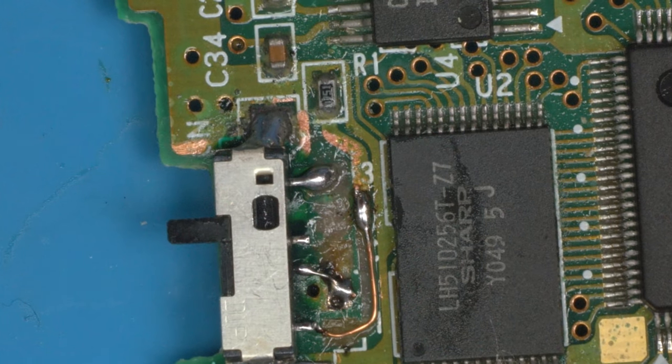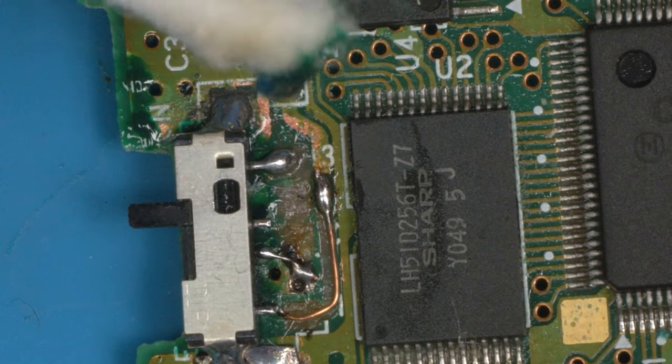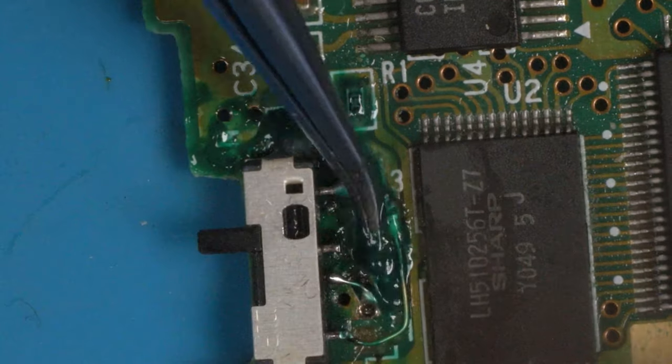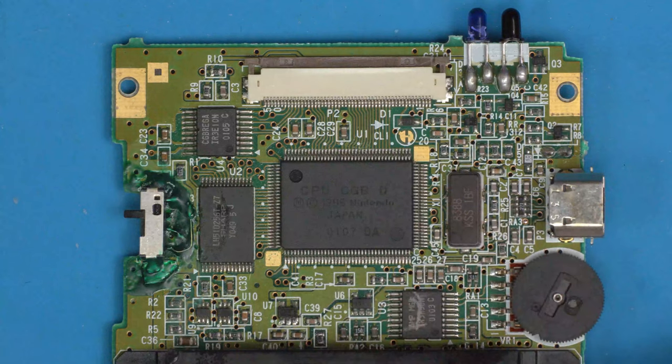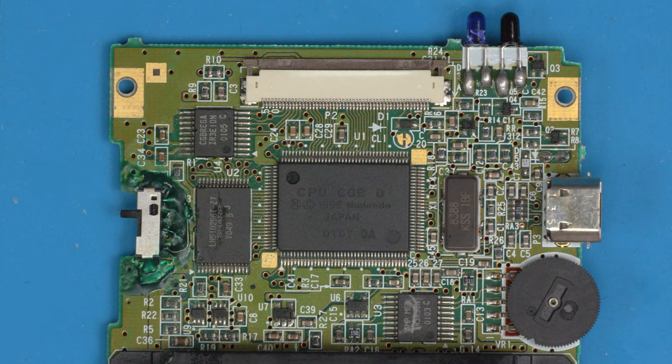I know it was in depth, but the main thing I wanted to cover was not just how to repair specifically a Game Boy Color power switch — I wanted you to understand how you can look at a board that's ripped anywhere and trace how you need to repair the circuit. You can use braided wire, copper tape, or anything else to bridge major areas. The ultimate goal is simply to restore electrical connections to all the points that were missing. As a finishing touch, you can blob solder resist over all the still-exposed areas — though it's preference whether you want to insulate them or leave them looking clean. Hopefully you learned something, and I'll catch you in the next one.